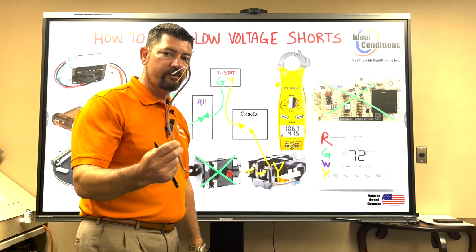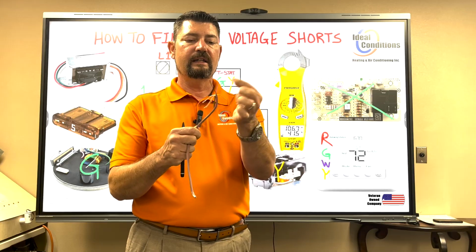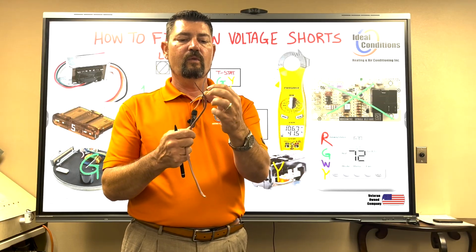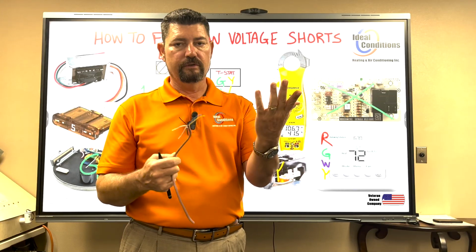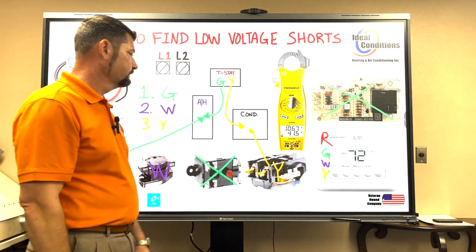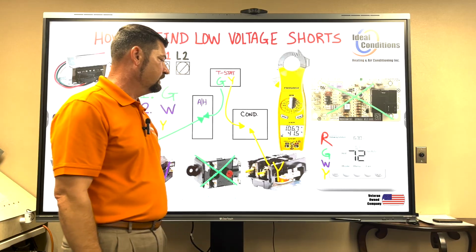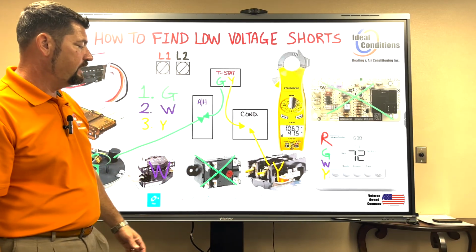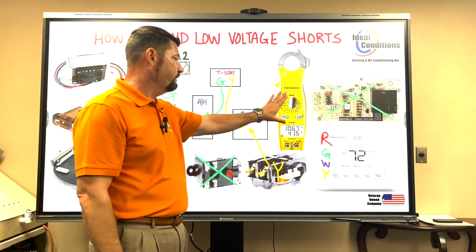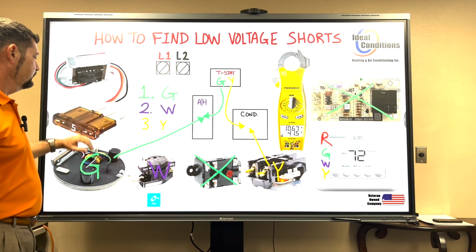And the only time you can have a problem with this wire is if you take this common here. If this common has a nick somewhere and this other wire has a nick in it and they're touching, you're going to have a short. Most likely that's all it is. But these contactors, they short out a lot. In the next video, I'm going to show you how to test all this out using a meter so you don't have to go through fuses.